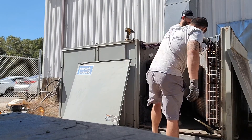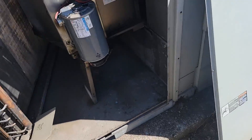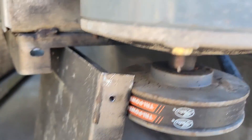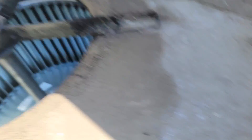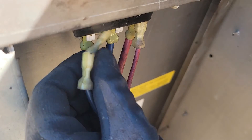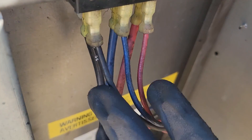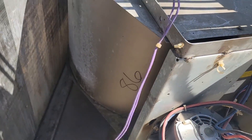Alright, it's in there. Got the housing in place. Those new bearings look great. I want to color for color on this when plugging the power up on these terminals here — these line voltage wires — so that I don't reverse the polarity and the blower doesn't spin in the other direction.